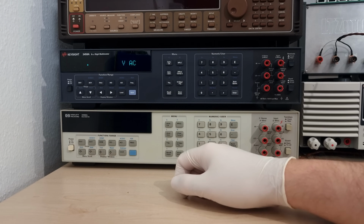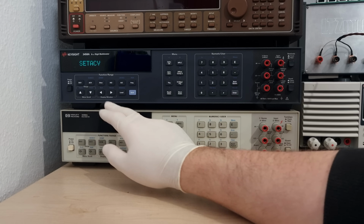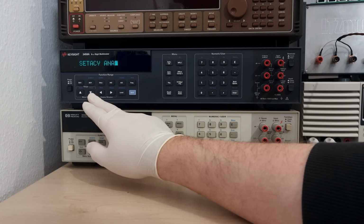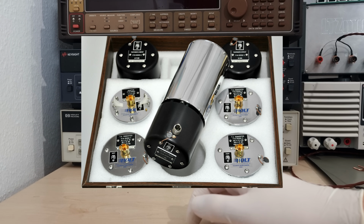In terms of AC voltages, the 3458A is a fantastic performer too. I've talked about the RMS converter hardware and the 3 available methods before. Analog computing for the fastest measurement speeds, random sampling for noise measurements, and synchronous subsampling for the most accurate measurements of repeating signals. I don't have a lot of AC experience myself, but word on the street is that thermal RMS converters are the way to go when the ultimate AC accuracy is needed.